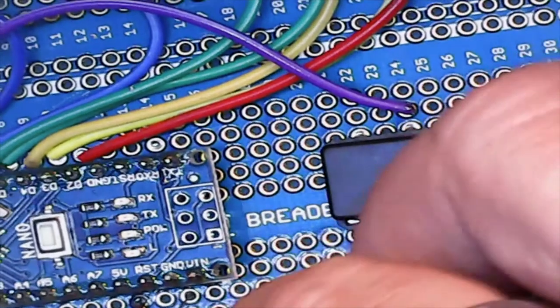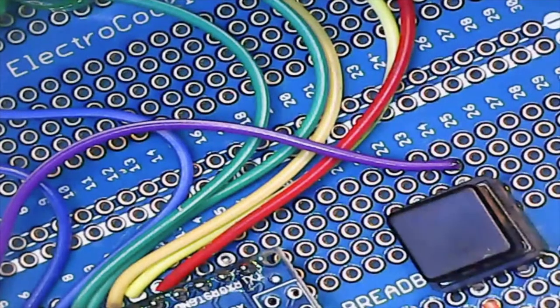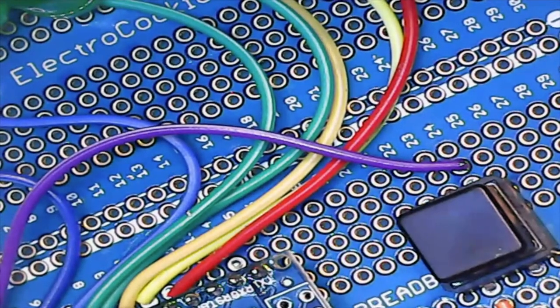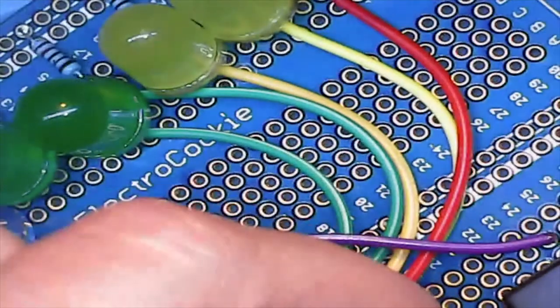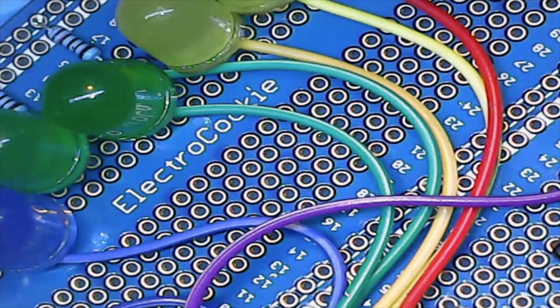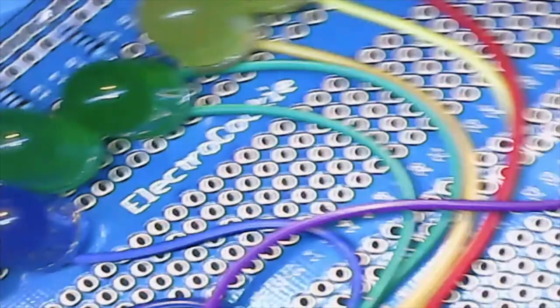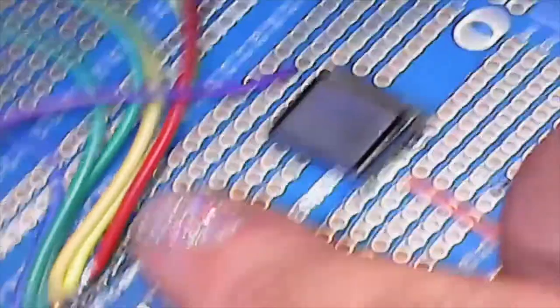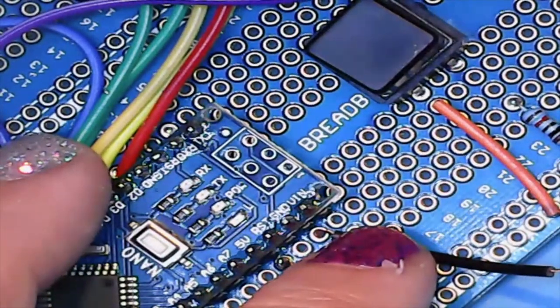That last pin next to ground is VIN. It's voltage in. So if you were going to, say, use AA batteries, four of them, to power this instead of, say, a little lipstick charger or just leaving it plugged in on your desk, you would want to put it there, because that will take unregulated voltage, whereas the 5-volt pin is actually an out, whereas the power coming in on the USB port is actually regulated. So, fun times. And let me pan back out. There we go.